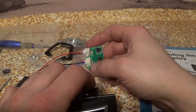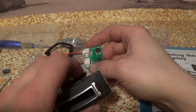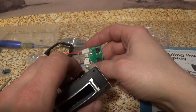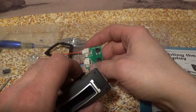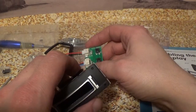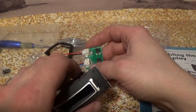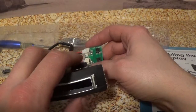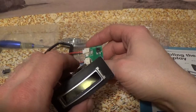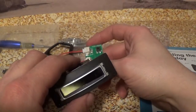Okay, and reading down below, you can test the LCD display using the same circuit board and battery box that you used to test the LED processor state indicator in stage 4. If you haven't already done so, unplug the lead from the processor state indicator from the socket marked out and replace it with the connector on the LCD screen power lead. Connect the battery box to the power socket. Make sure it is turned on, then press the button marked S2 to check that the diagnostic display LCD cycles through a pattern of colored dots as shown on the right.